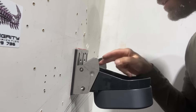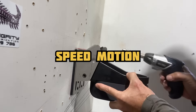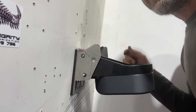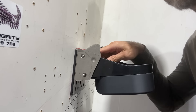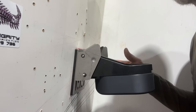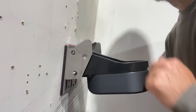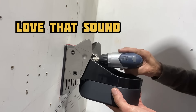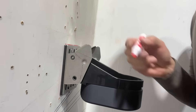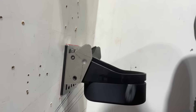So there you have it — rock solid — and you can adjust this now wherever you want. So if you want to lift up 10 millimeters, done. There's no way you could do it that quick if you didn't have the jack plate. You would have to take out the screws or bolts and do them all up again, and you'd have to re-silicone the holes so the transom is sealed. You can still use the wedges — just use longer internal bolts. Mark with a pen if you want — mark where you had it before as a reference.